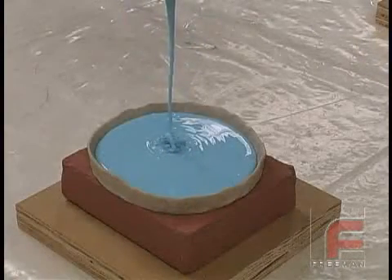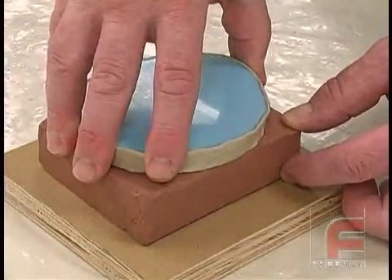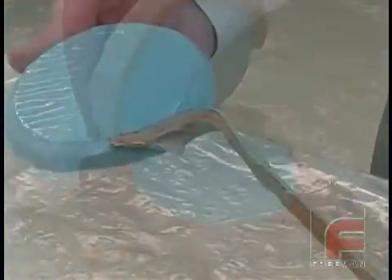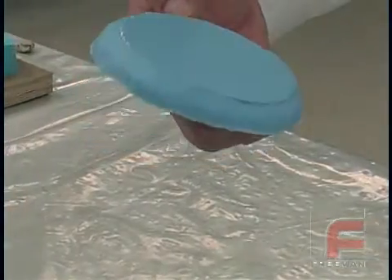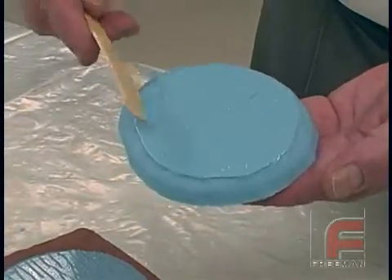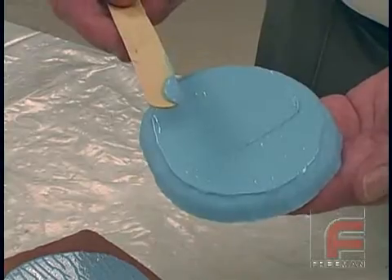After pouring V340 in this mold, we allow it to cure overnight. Upon demolding, notice how most of the rubber has cured, including that which came into contact with the non-sulfuric clay. The bottom, however, is still wet. Even after sitting an additional day, it still fails to cure, proving that proper sealing and releasing of sulfuric clay, vinyl, and wood is essential when using Addition Cure rubber.